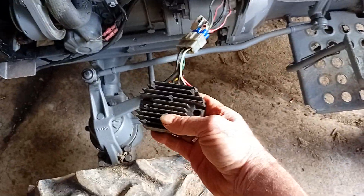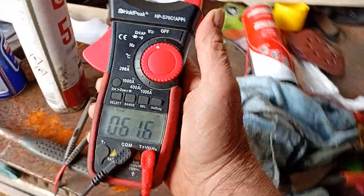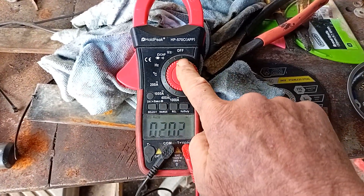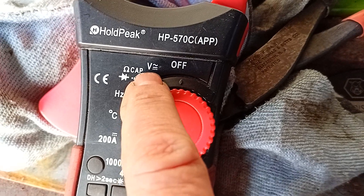So the question is how do we test? Start with your multimeter set on DC volts. You need to be able to switch the meter from DC volts to AC volts. This one has just one volt area, so I change it by hitting 'select' to get to AC — you can see it says AC right there. Some meters rotate a dial: the straight line with three dots is DC, the wiggly line is AC. We need both for this testing.